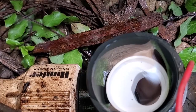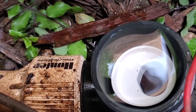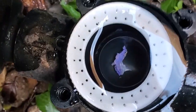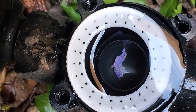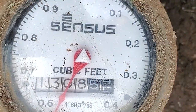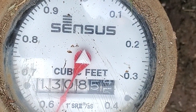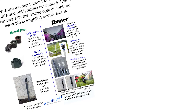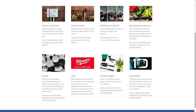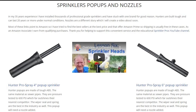You might wonder how that tiny water movement at the valve could be enough for the water company to shut off the property's water. I believe that big chunk of glue was originally jammed underneath the diaphragm, holding it open much wider — water would have been flowing through pretty well, and that would have justified it. When I removed the diaphragm, the glue dropped down into the valve. Remember the free downloads that can help with your irrigation, and the resources site link below for most of the products discussed in these videos. Thanks for watching — see you next time.